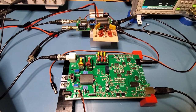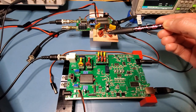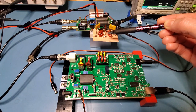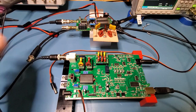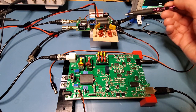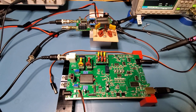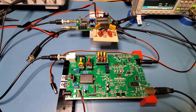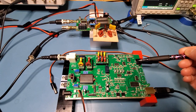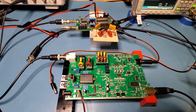So let's recap the test setup. You can see here I've got the Magnus radio, and here's the amplifier kit at the top. The output of the Magnus radio goes to the input of the amplifier. I've also installed a wire coming from the PTT signal on the amplifier, which goes to the amplifier connection on the Magnus. An optocoupler basically pulls the line to ground whenever on transmit.